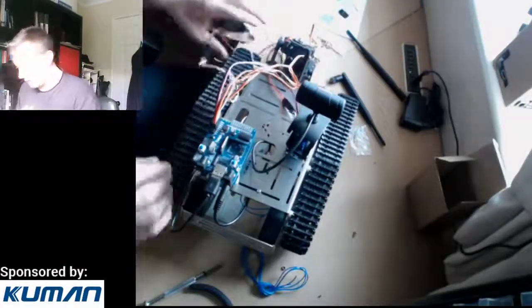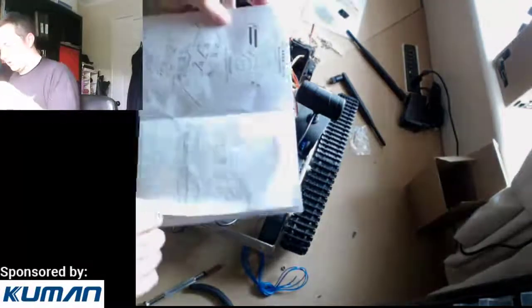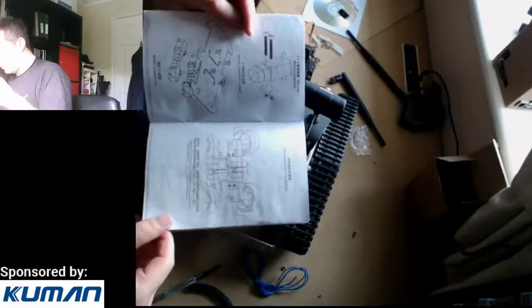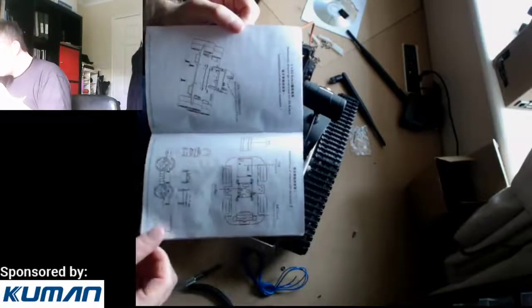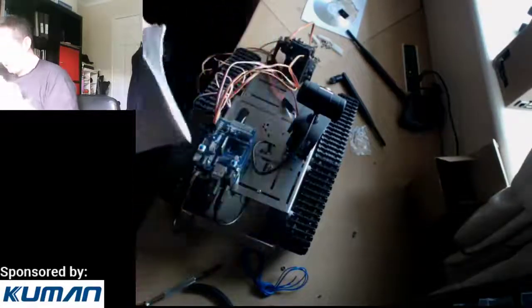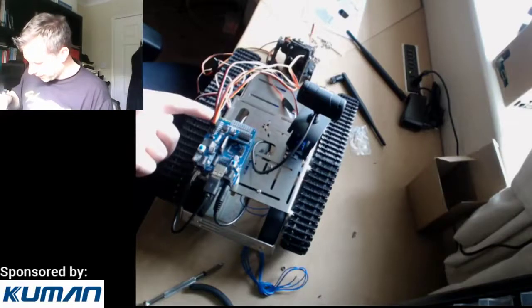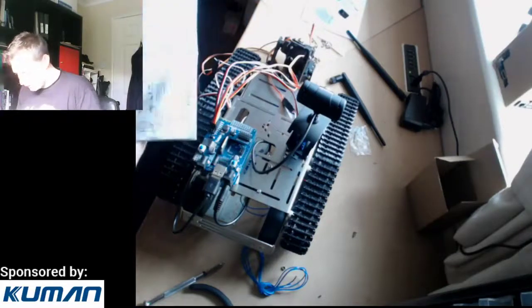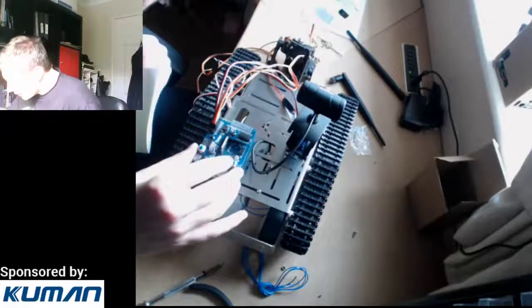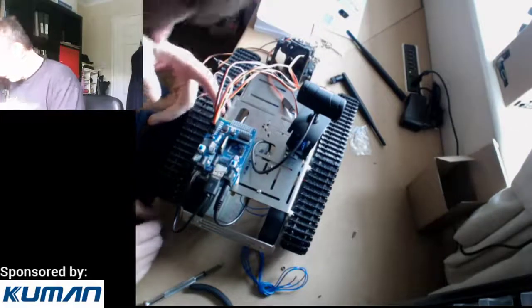So I've got servos, I need engines to be powered now. I need to find in instructions, there is something in here, but that was on wheels. But let's see if we can figure it out, because there are 2 engines instead of 4. Mainboard, camera. Doesn't really tell you where to connect the engine, so we need to figure it out. Now, something tells me it's gonna be those two green sockets here. Yeah, they're M2 plus, M minus, and the other one, it doesn't tell you. So we have 4 cables anyway, so I'd expect 1 goes per each.